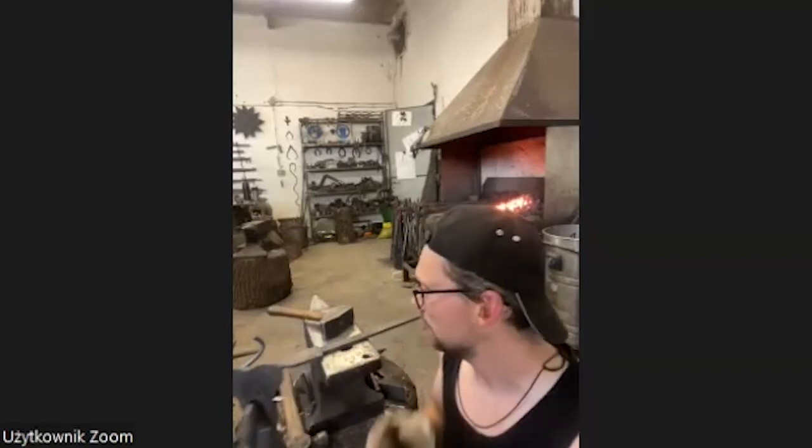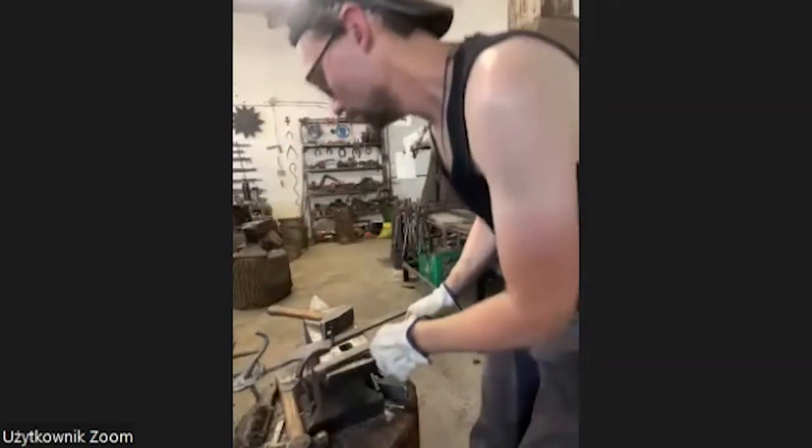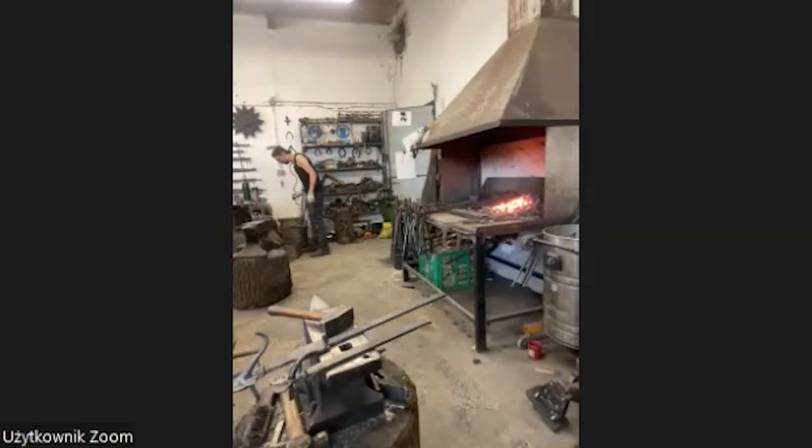It all depends on what starting material you use. Like I said, today I use this 50 by 8 millimeter steel, but you also can go in the other direction. I mean, I don't remember the word for doing it, but you can push the material and get this to about 50 millimeters from 25. But you have to be careful to get the right thickness, to get enough ear material. It's called upsetting. Upsetting, right? Yes, I couldn't remember. I have one more elephant head.